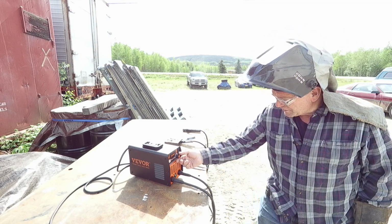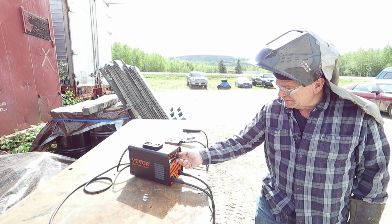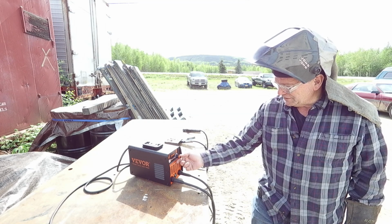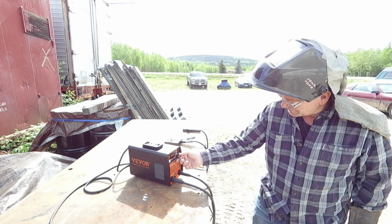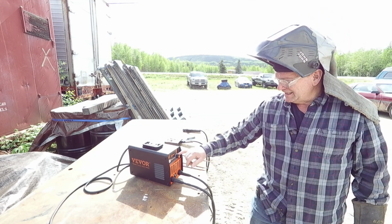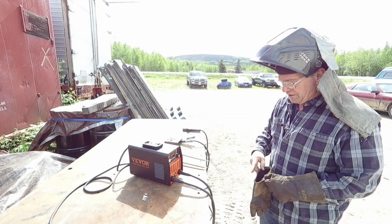The thing we were not aware of, besides our 120 for the amperage, was that there's a button in the middle, you push it and you can have a hot start. It was at 50 apparently, which is the normal setting, so we're going to just try it at 100 for fun. And then arc force, I'm going to just crank that up to 100 also. And I don't know what the VRD, oh, we're back to current. Okay. We don't have a choice on VRD anyway, whatever VRD is. Or maybe VRD is just telling us that that's what this display is for. So we have current there, we're at 100, we're at 100, back to current at 120, and we will see how that goes for starters.